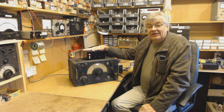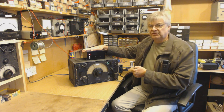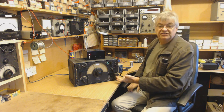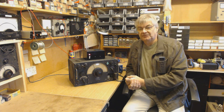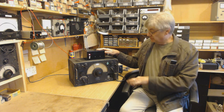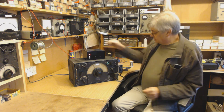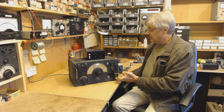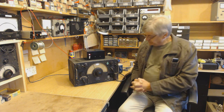One thing about the power supply - it was a couple of years ago since I built this - the negative HT doesn't go straight to earth where it plugs into the radio here. It doesn't go to deck; it goes through a resistor network, and that's where the bias comes from. I think it's 6.3 volts LT and HT around 220 volts. So coming down the lead from the power supply into the Jones plug, you've got positive HT, negative HT, chassis, and LT.